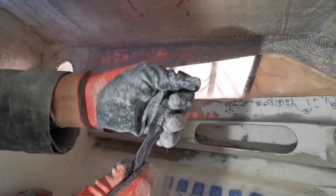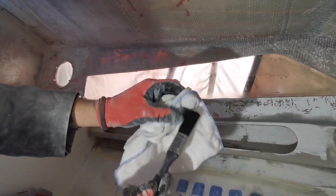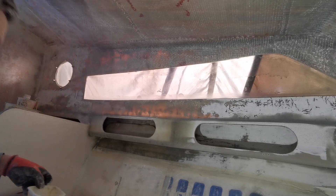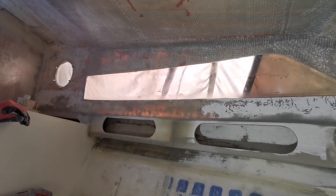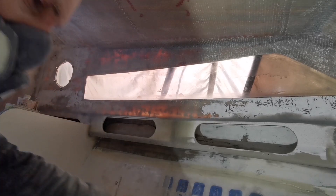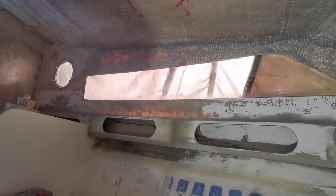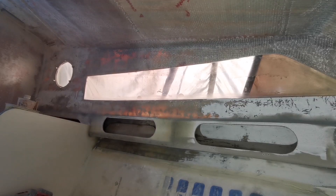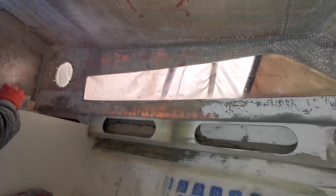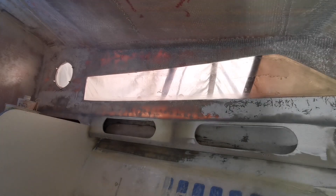There's my brush that I keep cleaning — it's got a bit hard but it ain't solid. A little bit of acetone and she's good to go again. You don't need to throw your brushes away every time. Obviously if you're doing top coat finishing, by all means use a nice new brush. But if you're doing resin or just brushing a bit of gel coat to cover something up, there's nothing wrong with that. If you're doing your pride and joy with a top coat you might want a brand new brush — depends on what sort of finish you want and how much your boat's worth.